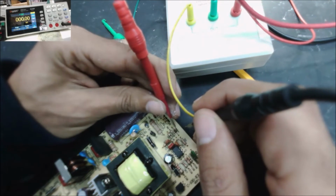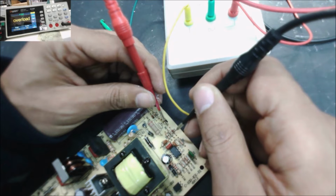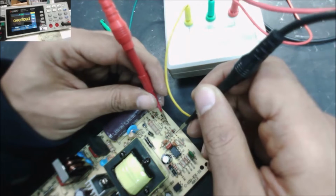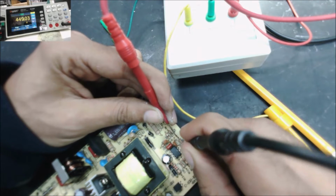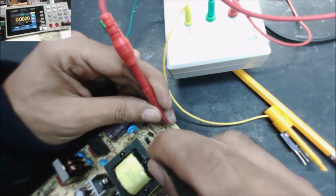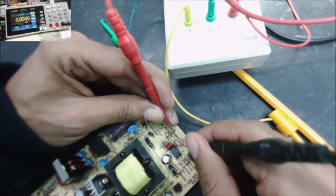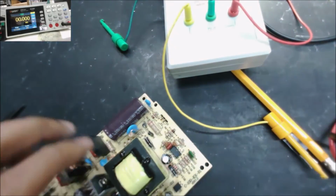This one is 51 ohm. Yeah, 51 ohm is low. No, it should be okay, because this is 5, 1, 51 ohm here. 5, 1, 51 ohms. So this one should be okay. This one is 400 ohm. This should be like 22 ohm. But it shouldn't be like that, because it has the yellow. 400 is kind of low here. So let me remove that diode.